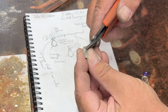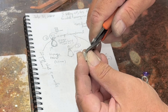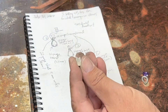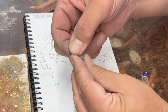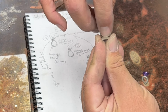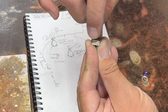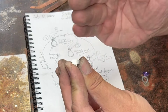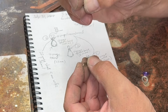I don't know, it's a little more than 45 degrees, I think. But I cut an angle like that. Because what I'm going to do is I'm going to use the Dremel and cut a notch using one of those knife edge kind of burrs and create kind of a little trench there. And we'll be able to fold it inwards and bend these downwards and then solder them, which is what I did here. So, and then we'll use this one.